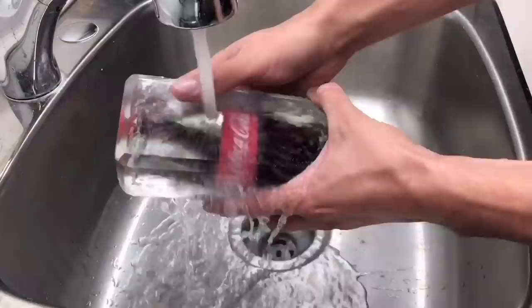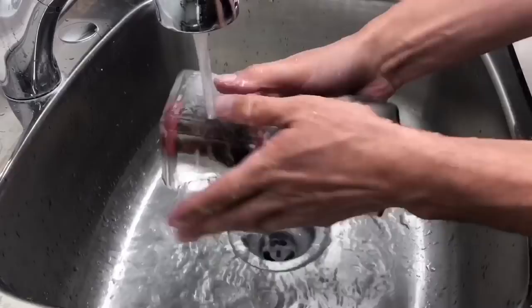Finally, polish using 400 to 4000 grit soft pads. You can see how much it clears up just using these pads alone. Once it looks fairly clear, rinse any remaining dust off the epoxy and allow it to dry.